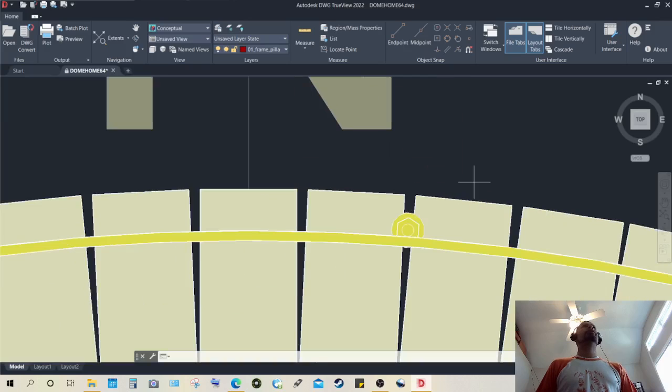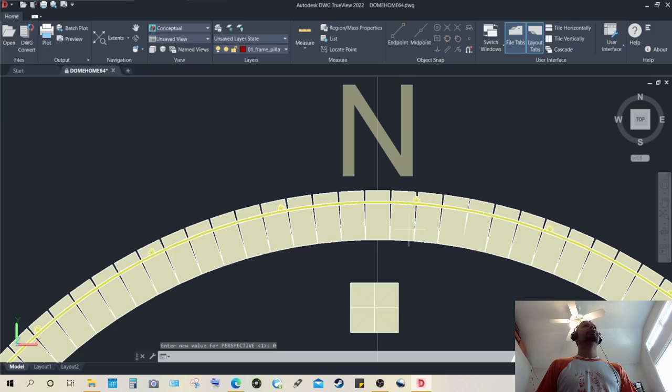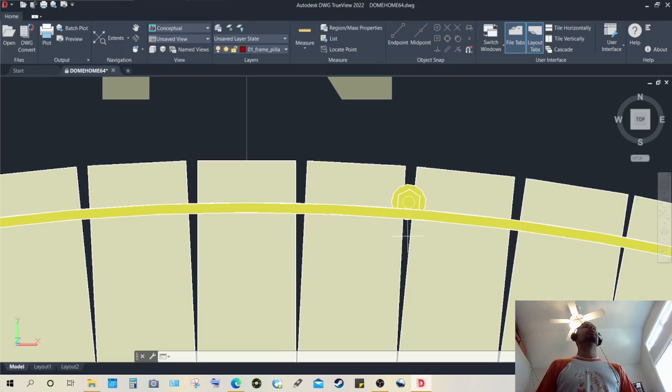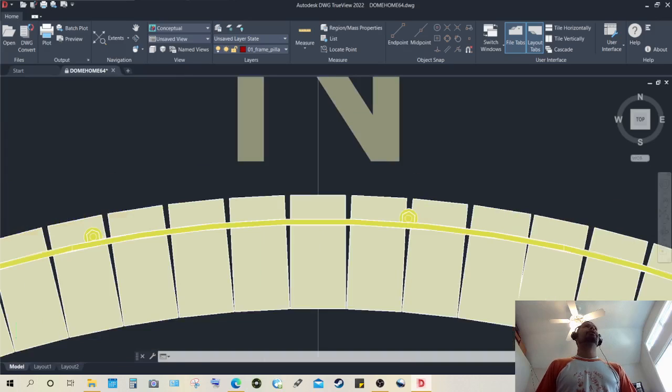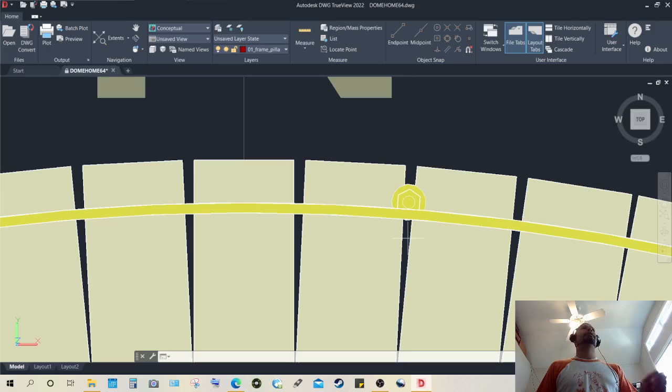And of course, in between those narrow voids is where the mortar, the cement mix, would go to bond these blocks together. Not only will these blocks be bonded together with mortar, but they will be bonded with steel, either rebar, steel wire, or steel belts, whatever your choice may be, or something else that's long lasting and corrosion proof.